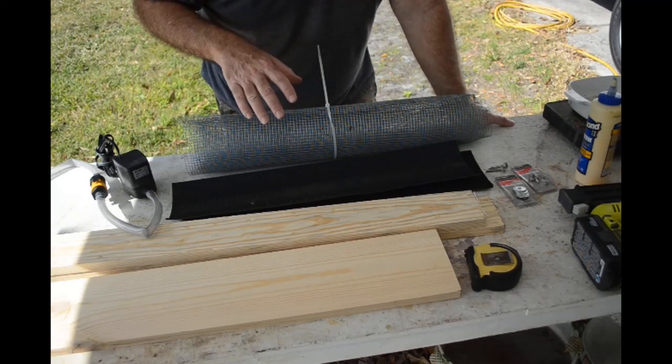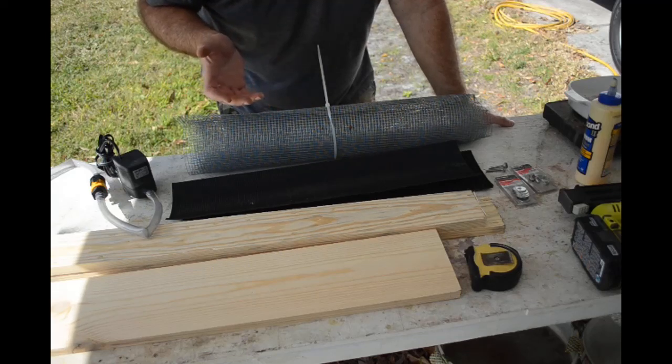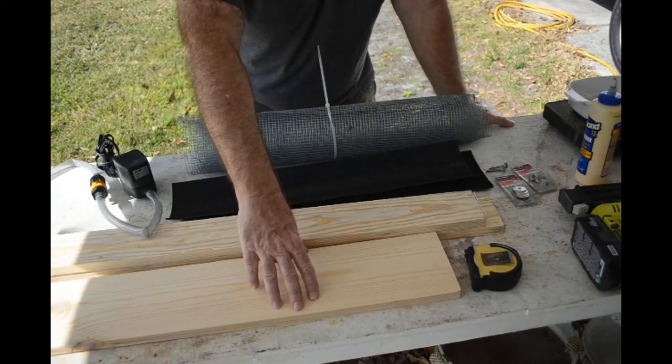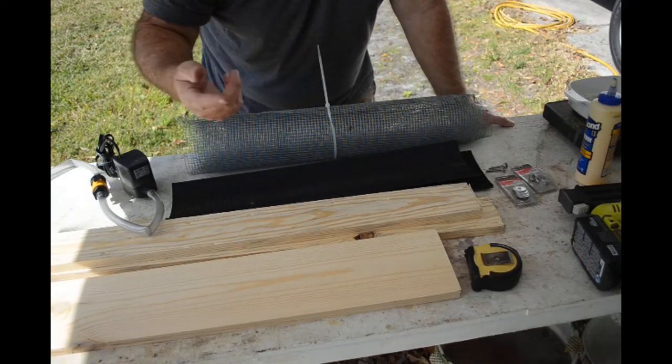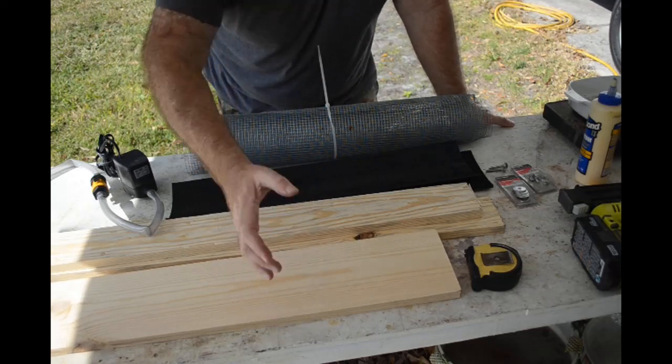Well, I'm going to make this sluice basically 5.5 wide by 3.5 tall. And I'm going to do that using 1x6 for the base and 1x4 for the sides. And the dimensions on lumber are screwy. So they call it a 1x6, it's actually 5.5 wide, okay?